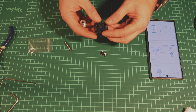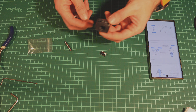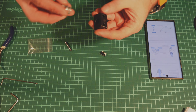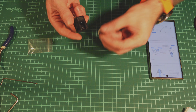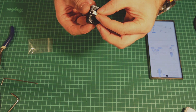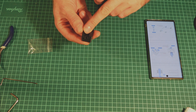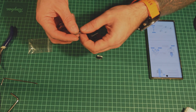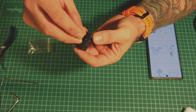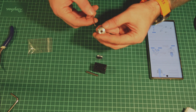At least let's try. Basically, what is the Z-min switch? This is a block of plastic which has a pulley on top, and the pulley must be deflanged — I'll explain what that means later. You install one of your end switches to the very bottom, with a JST connector here. When your nozzle or tool head presses this shaft, it presses the micro switch, and voila — you get the head measured correctly.